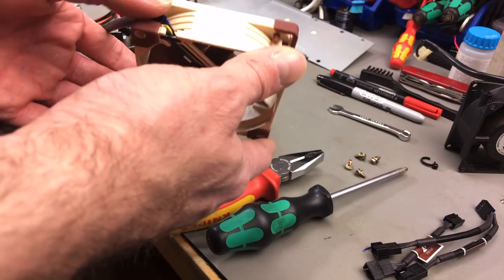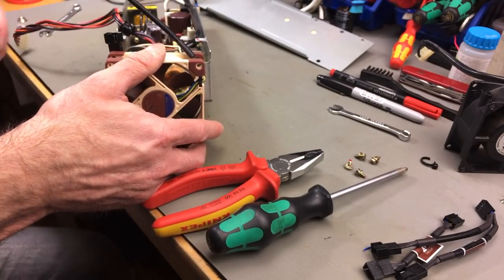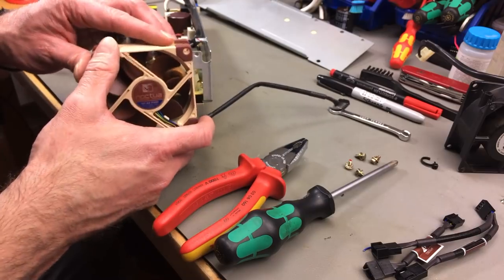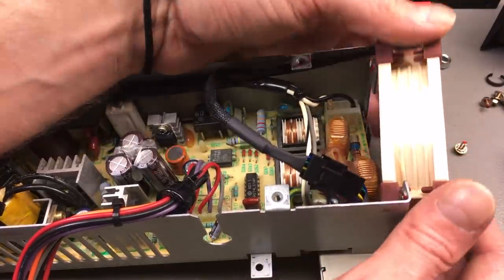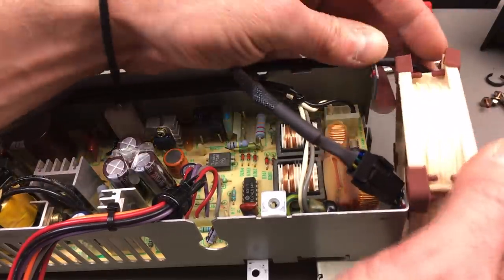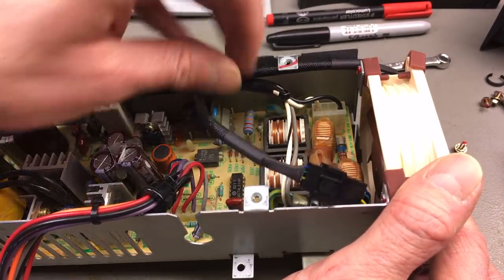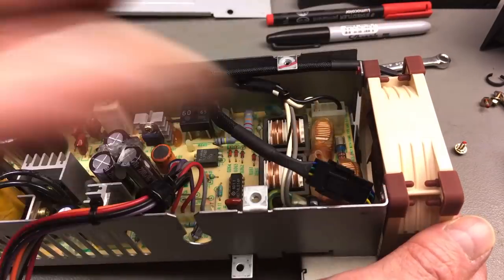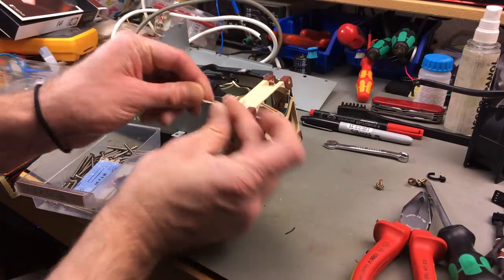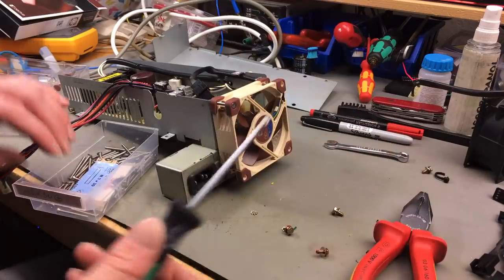So we need it to blow out. It has some markings here. It blows out and turns in this direction. So it needs to go like so. So the cable is going to run through the opening where the original cable went, and we are making sure that the fan is blowing outwards. So it's going something like this. It's going to be cable tied here. Maybe another point somewhere. But yeah, I think I'm just going to find some regular screws that fit this. So I'm actually going to use these long M3 screws that I found. Yeah, this should be perfect in the end, I guess.